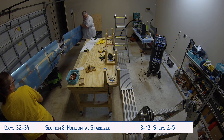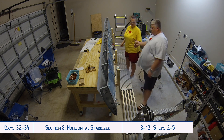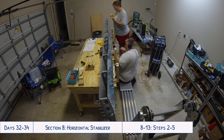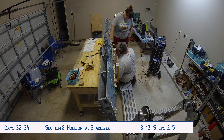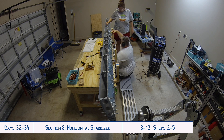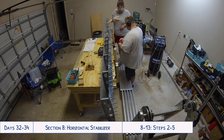If you're wondering why we flipped over the horizontal stabilizer and shook it, we were trying to shake out the shop heads for the rivets that we had drilled out, just to make sure we got everything out from inside the stabilizer before moving on. We're now into day 34 in the video, and by the end of this day we will have finished riveting the skins — top and bottom for both sides — to the flanges of the front spar assembly, the stringer assemblies, and all of the in-spar ribs. We really did enjoy having this soft cradle; we moved the horizontal stabilizer back and forth quite a bit to give Tyler better access with the rivet gun, then flip it back so I could get a better view of the shop heads.